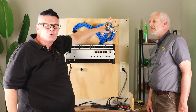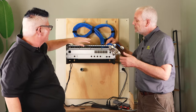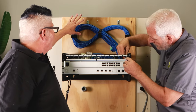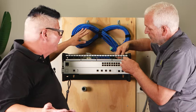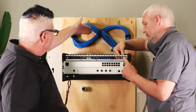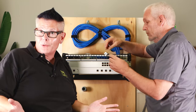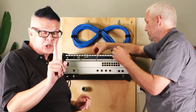We've already pre-terminated these two shielded keystones and we're going to show you how they all snap in. While Dave is snapping in a few keystones, I'm going to explain what this is — if you're a professional installer you already know. This is called service slack or a service loop, and the purpose is to provide enough slack for your individual installation so that if you need to move the rack around or re-terminate cabling, you've got enough slack to work with. As everybody knows, the most expensive cable in the world on a per-foot basis is the one that is one inch too short.